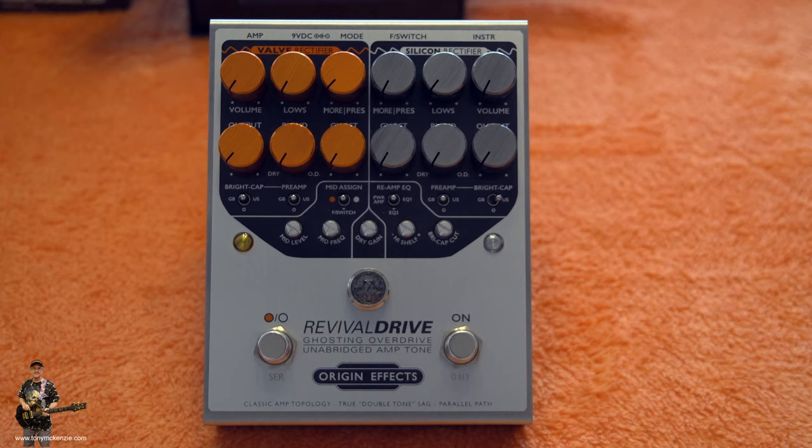There's also a solid-state silicon and valve rectifier channels. They're in there, plus a simulated mains power supply to generate realistic sag characteristics and ghost tones. Well, if you've got a Road King 2, you'll know what sag is and solid state is and those sort of things. But on the older amps, you'd lose some of the voltage when the amp's trying to get more out of the transformers and power circuit than it's capable of producing, and it's affected the tone. That's the simplest way I'd describe it.